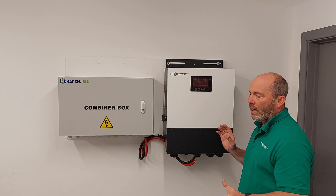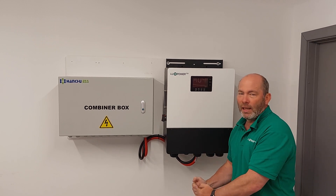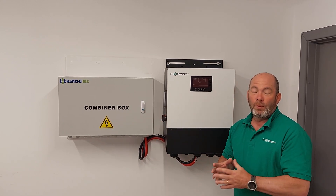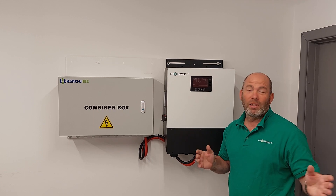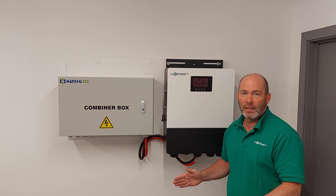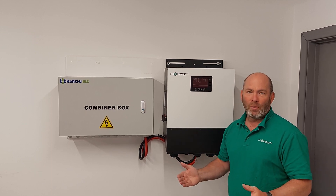Really importantly, we need to limit a couple of bits on this. If you're doing this in a single stack of batteries, not using a combiner box, we need you to put those batteries online and allow us to do a firmware upgrade on those batteries before you even go up to the site. Just do it in the office — put your GreenLix batteries that you're going to use with this installation on the floor, put the cables in, put them all online and allow us to do a firmware upgrade.